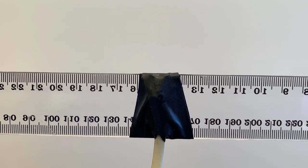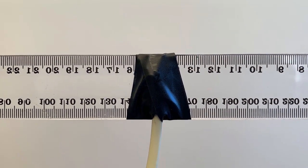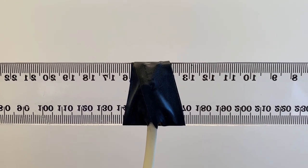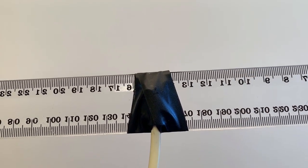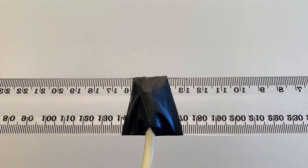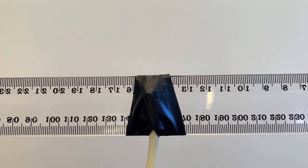Now I focus on the front side of the sensor. I point the front side of the sensor vertically and search around that point until SarkTrack stops beeping. Due to heavy filtering while calibration is in process, the data takes a few seconds to settle at each point. This is point number one complete. Next, I point the front side north at my local magnetic inclination and search around again until SarkTrack stops beeping. Sometimes, if the rough calibration was sufficient, there are no beeps at all at some calibration points, so I just move on to the next one. This is point number two complete.